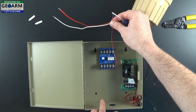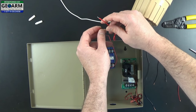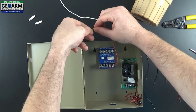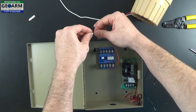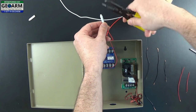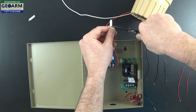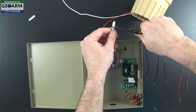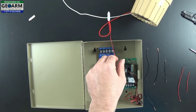You're going to locate your other positive wire and twist these two wires together. Locate one of your wire nuts - the open end. Make sure these get inserted pretty deeply into the wire nut. Use the top of your wire strippers while holding the wires in, close down, and be careful not to pinch your fingers. Go all the way up the connector to make sure it has a solid grasp of the wires so you never have to worry about any connection issues. Now the positive is taken care of.